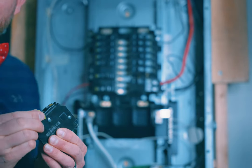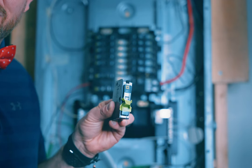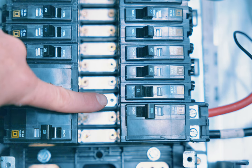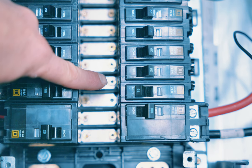That's for the Square D clip-in circuit breaker — no screws are required to remove it from the panel. In my demonstration sub-panel I've installed two different types of Square D 15-amp breakers. This one is your typical circuit breaker, and this one has a screw that screws right into the hot bus bar. You're going to have to remove that screw before you can rock out that circuit breaker.